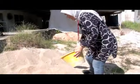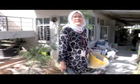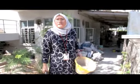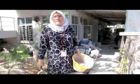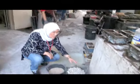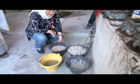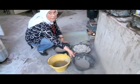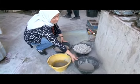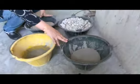First, we're going to take the sand. I've given in the lab manual the amount of cement that you need to use. You need to calculate the weight for the cement and gravel to use. As I said, you need to coordinate your group members on who prepares what. I prepared here materials to mix a concrete of 1 to 2 to 4. Now I have here the sand. This cement is 2200 gram. It is in the manual. Please read your manual. For different concrete mixes, there's a different amount of cement that you require. So I've taken 2200 gram of cement.